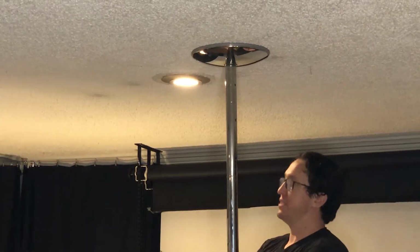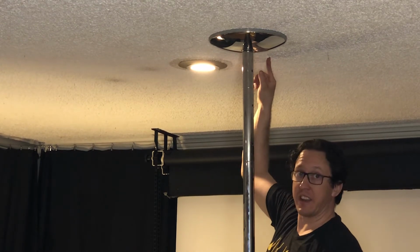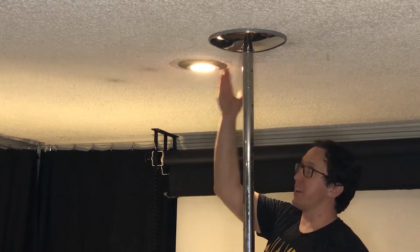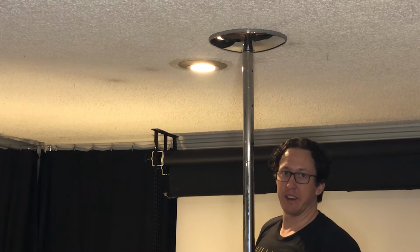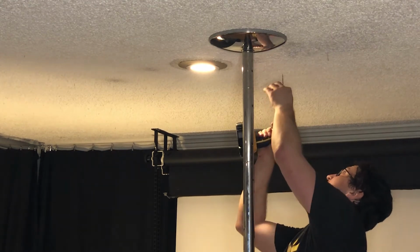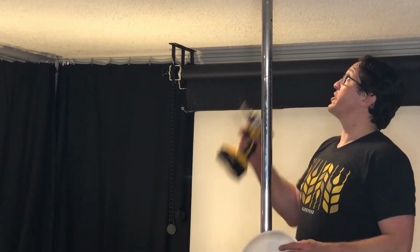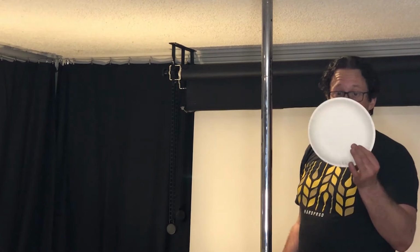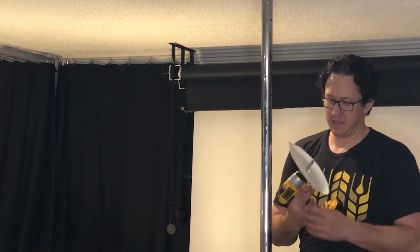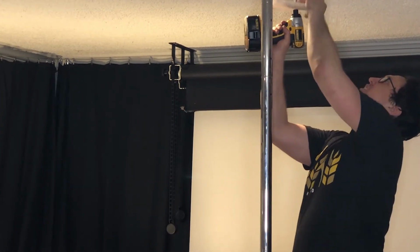I'm going to put a long screw through the ceiling so that I can know where it is in the attic to know where I want to place the hammock, and we can build our additional support from above and know where this hammock is going to go. So I'm just going to line this up. Oh, actually, a handy trick when you're trying to screw into the ceiling is having a paper plate and just poking a hole in it with your drill. And then wherever you're wanting to locate it,